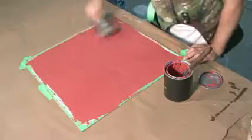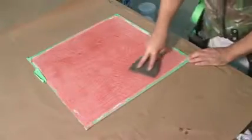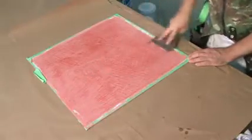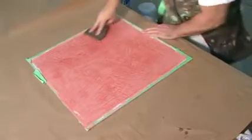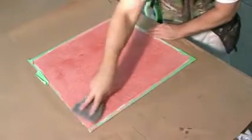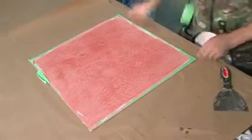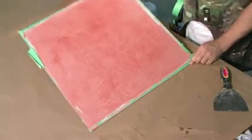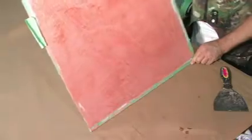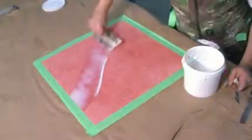Polish Marmorino with the edge of the trowel to reveal all the movement and texture created in both layers. Polishing Marmorino is easier than polishing smooth lime plasters because the added thickness caused by the marble chips gives this product a longer drying time. When the polishing has been completed, you may seal the surface with Duragloss and either trowel or machine polish to achieve the desired sheen.